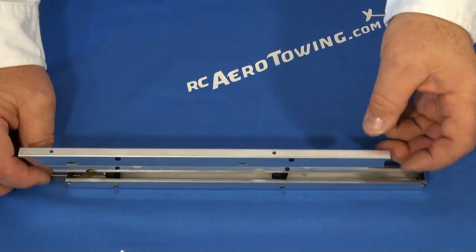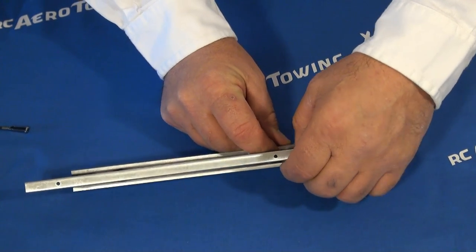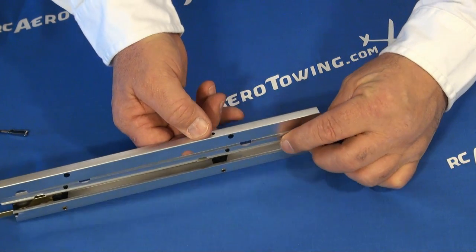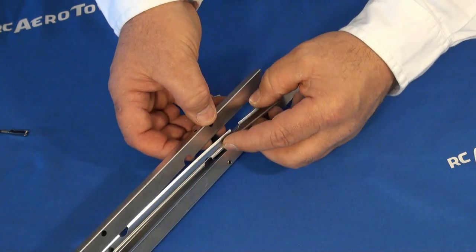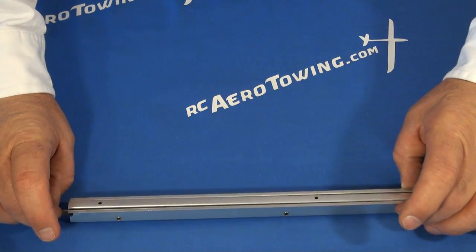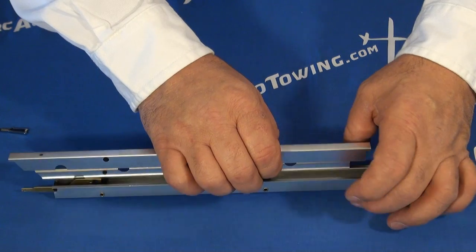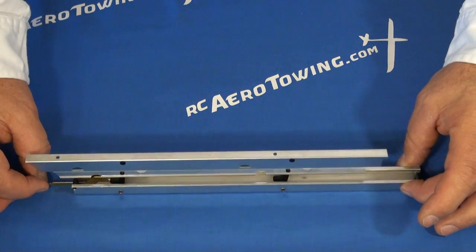If the pins were to work their way out over time — and I'll reproduce it here — you'll notice the pin is a little loose and floppy, and the blades will have a tendency to bind on each other. They can also get bent, and next thing you know it's not going to want to operate. So in terms of maintenance: open the spoilers, check your blades, make sure they're straight. If you need to bend them, apply light pressure only, and you can make the spoilers operate consistently.